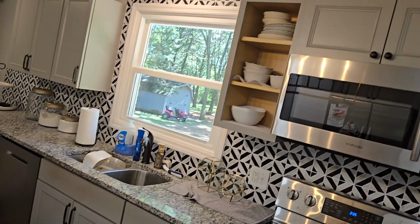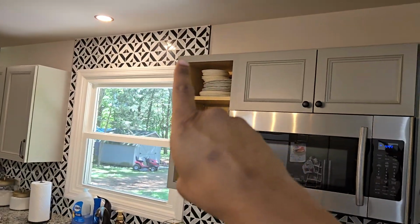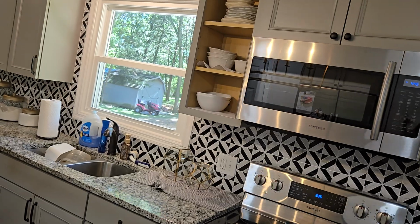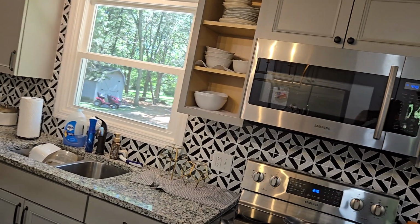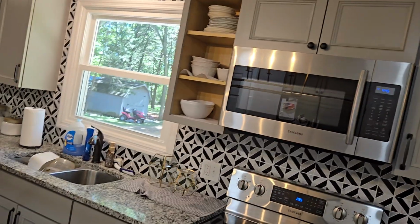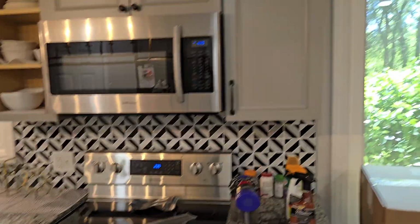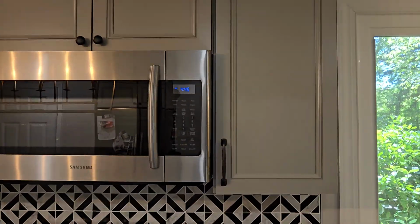So that tightest point that I was able to measure, from that corner up to the ceiling, is 10 and 7/8 of an inch, which is the point that we'll want to go ahead and use for all of these cabinets, because that will be the tightest area there. Now, with that being said, we do have a couple of things that I do want to point out.